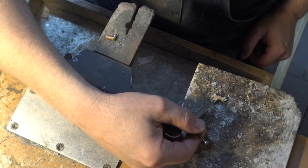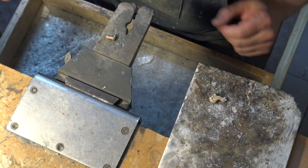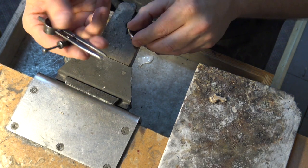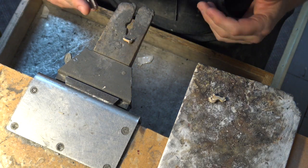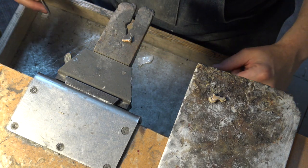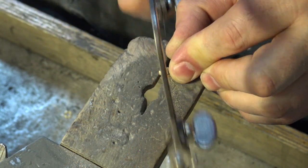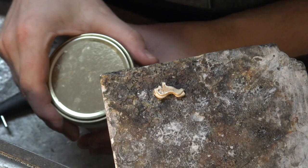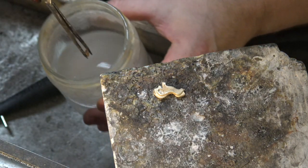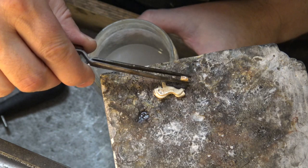Measure approximately a piece that's going to fit into the crevice we made. I'm just going to roughly mark it and come over to the sprue — I'm using my dividers just to get that measurement. You can eyeball this; you can add more if it doesn't work the first time, so don't stress about that. Just get something approximate to what you need to fill the hole. I'll cut this off, and once you have your piece cut, take this little piece and dip it in the boric acid as well — this is our fire coating.